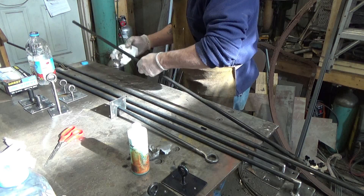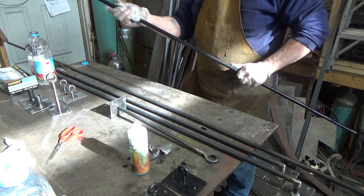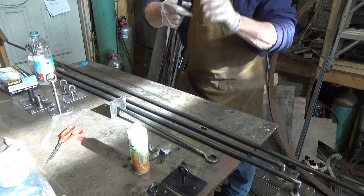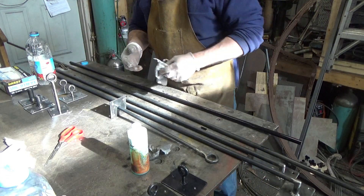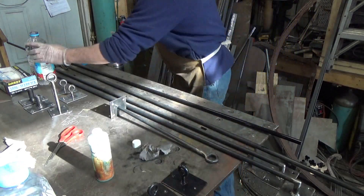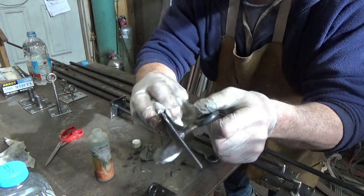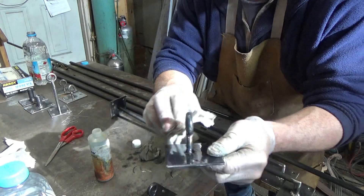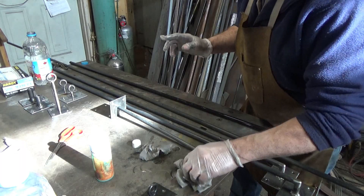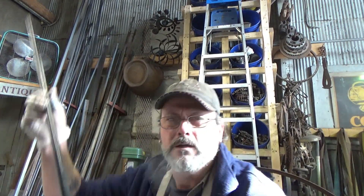You know, they say rinse it, but with this rod we're just going to wipe it off generously with water. They have videos on their website showing this process. Let that dry and that's all there is to it — wipe it on, then rinse it off. Obviously a second heavier coat worked well. You can just keep going until you get the darkness you want. Then you would seal it — it's not a protective coating — so go ahead and apply poly, clear coat, or whatever you normally use after everything's dry. Simple. And you get a nice, dark steel.